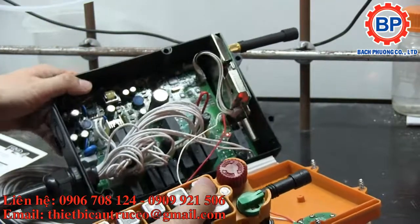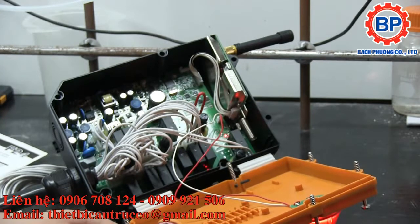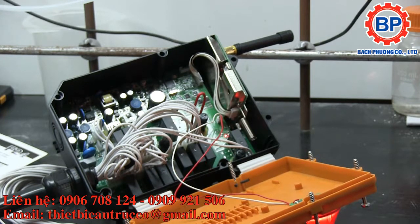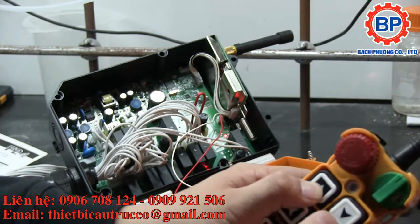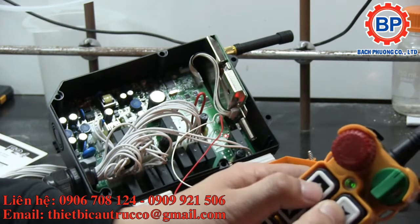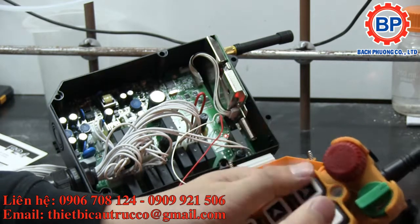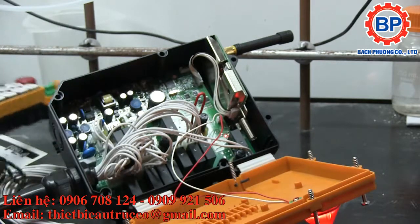So more on the feature where it gets jammed. There's up, there's down. If I jam up and down at the same time, both of them cut out. So at least from a functionality standpoint, you're not going to get weird, unexpected behavior. They lock themselves out. Once you press one and you press the other one, it locks it out. Then no combination of the two will allow you to trigger it until you release both of them to reset. So that's not entirely unexpected.